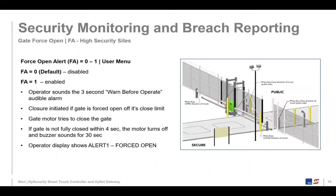Let's take a closer look at some of the features possible on this intelligent Smart Touch Controller system. There's a lot of power in this board — we've put a lot of feature functions on it. With those user relays, we have about 37 canned options. So if something is on an open limit or closed limit, you could wire a relay and say: when it's on this limit, turn on this light or sound this alarm. Here we're looking at some security monitoring and breach reporting.